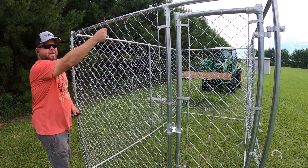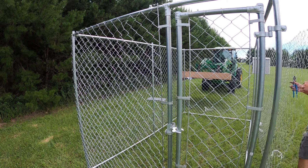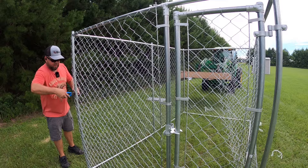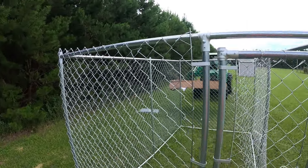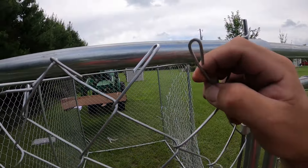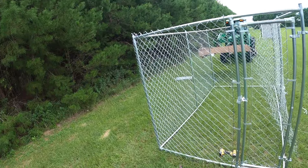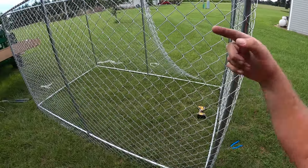What I'm doing now is going around getting any odd spots out of the wire, pulling it around a little further. You're going to have to work it around a couple times to get enough to come all the way back around. You can actually take your pliers or a hammer, stick it in the wire, and pull it tighter around a post. Now's the time to go around the top and the bottom of the wire. When you see pieces that aren't hooked correctly or bent in shape, or ones that are apart — now's the time to put it together. Because once you tension all this, it's going to be extremely difficult. Take a few minutes to go around and find all the loose pieces, then loosely go around, twist the wire, work the tension out, stick something in like a hammer or pliers, pull, and keep going around.